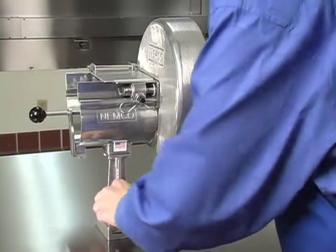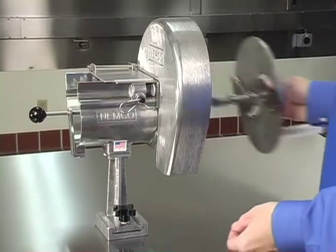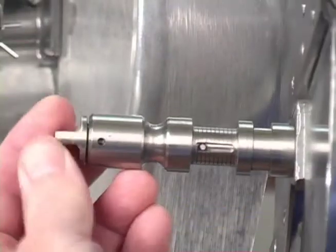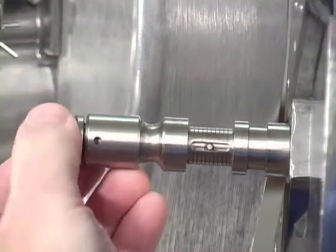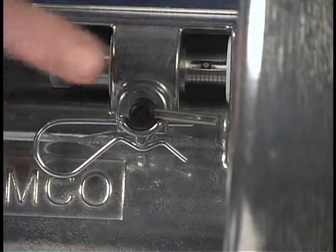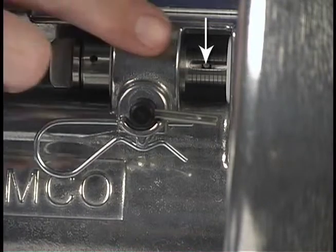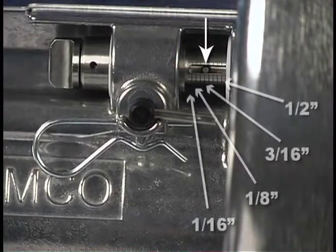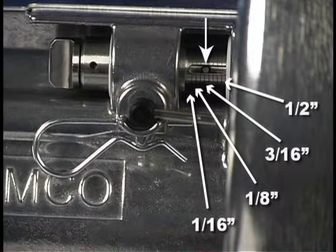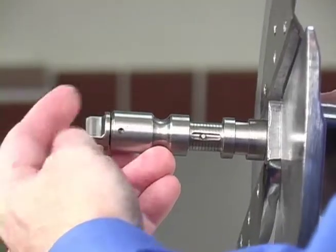Check the slice thickness setting. Remove the adjustable slicing unit by turning the shaft lock to the left and pulling on the handle. The slice thickness is easily adjusted by holding the handle stationary and turning the adjusting screw at the end of the adjusting shaft assembly. The thickness of the slice is indicated by the alignment of the pin in the slot and the lines on the recessed portion of the main shaft. These lines are one-sixteenths of an inch apart, so two lines equals two-sixteenths of an inch, or one-eighth of an inch; three lines equals three-sixteenths of an inch, and so on up to one-half inch. Simply turn the thumbscrew to lock in your setting on the easy-to-read calibrated gauge.